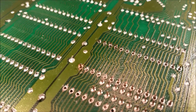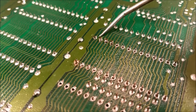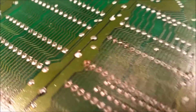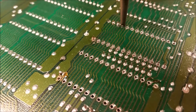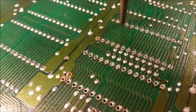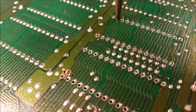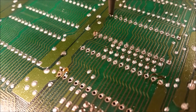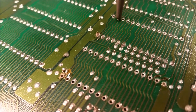It was on my second pin here and these ones were giving me some problems. What I did is went ahead and reflowed them and then I'll go ahead and re-suck them out. Let it sit on there for a little bit and suck them — and sometimes that does it.